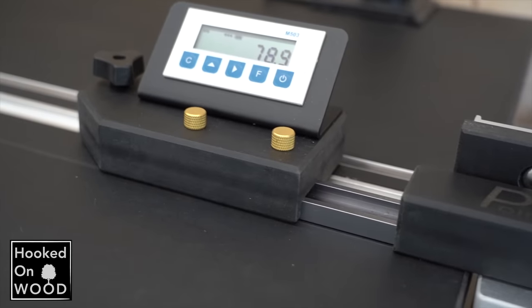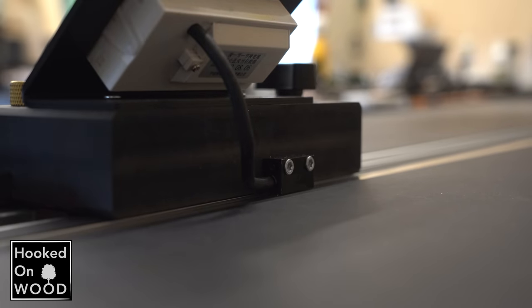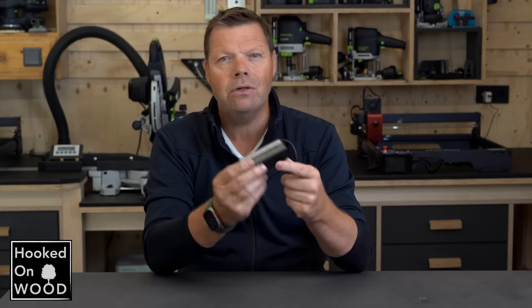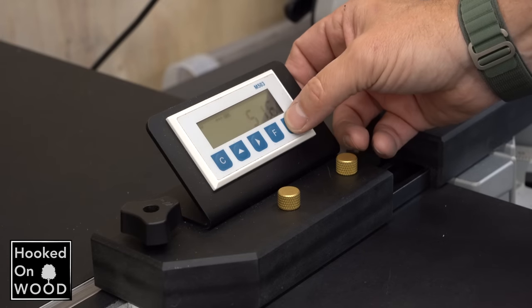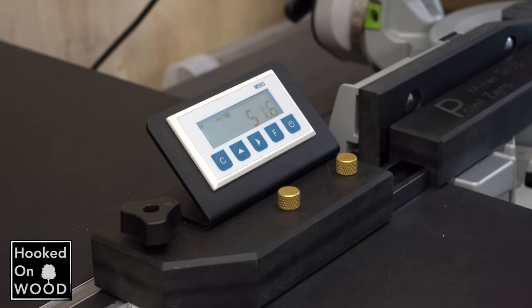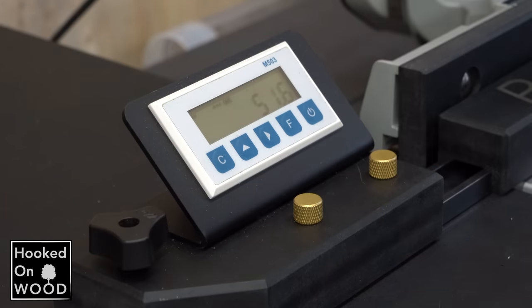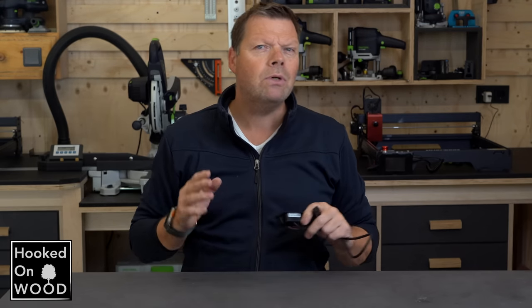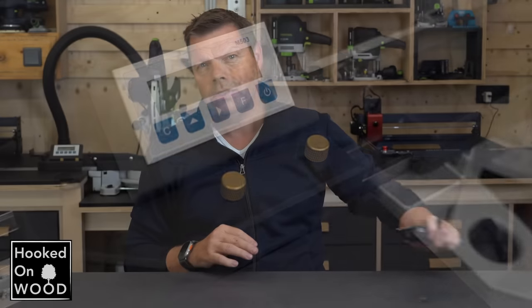Like I said in the beginning, I have some great ideas that I hope will work. There are some important things if you want to build this digital miter stop yourself. You see a nice short cable from the display to the sensor. I had to shorten this because it comes with a longer cable, but the other device comes with a significantly shorter cable already. The strange thing is that you cannot turn off these devices. The ON/OFF button is for the backlight, but you cannot turn it off. I contacted the vendor about this and he confirmed it. However, he told me that the batteries would last a year. I have had it for over one month now and the battery indicator substantiated this. I placed the display in a nice holder, but it was not that nice when it arrived, so I had to repaint it myself for a better look. Not that much of a deal, but just so you know.